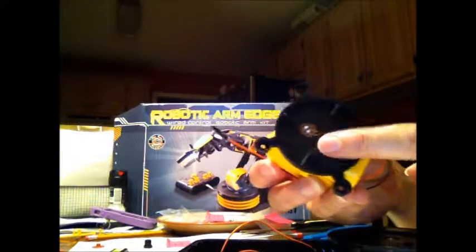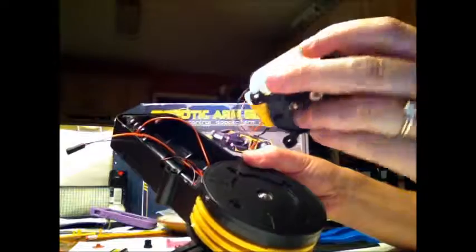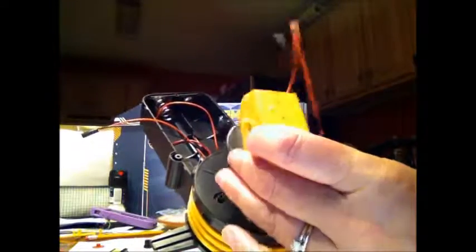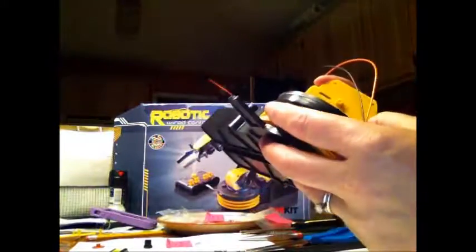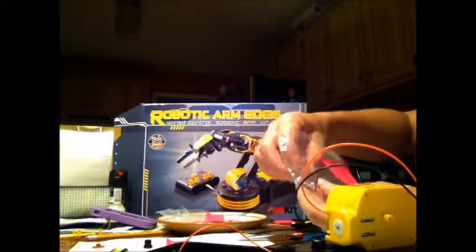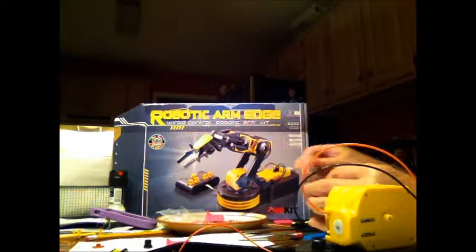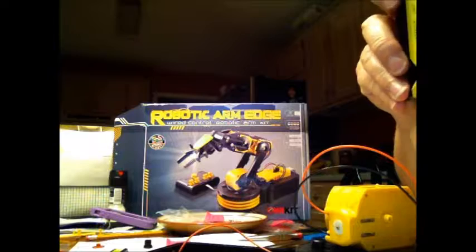Once you mount your F3 piece to your motor, you're going to take the piece that you assembled before that. And if you'll notice, you have these pieces sticking out on each corner, and there's the gear here that you can see in the motor, and that's going to be facing down, and your motor will just snap in there, and then you're going to secure it with 4 P12 screws. Again, I have these also in a bag because there are 11 of them, and they're also tiny. And you're going to put one in each corner.